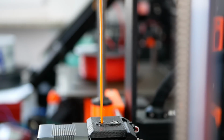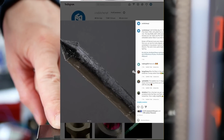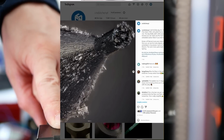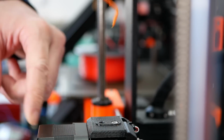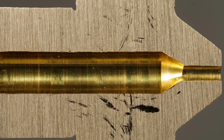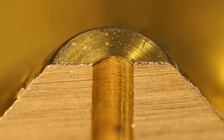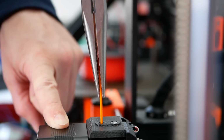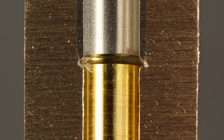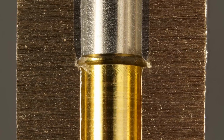If you've watched my previous videos or maybe follow me on Instagram or Twitter, you'll know that I love cold pulling during material changes, simply to remove all of the residues and reduce the necessity of purging. Revo makes this even simpler because not only are the internal surfaces super smooth, but there is basically no undercut between the nozzle and the heat break. Hence, filament slides out really easily. Don't let my cut-ups fool you, because that was a beta nozzle with a length problem and a small concentricity problem.